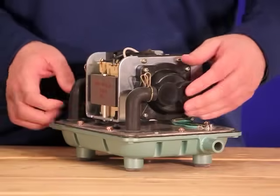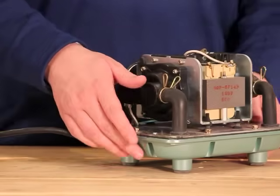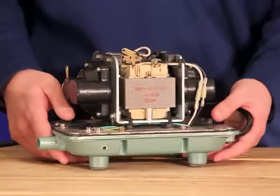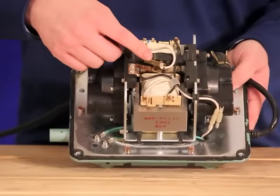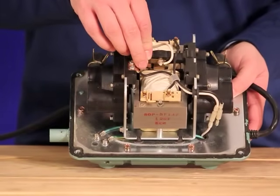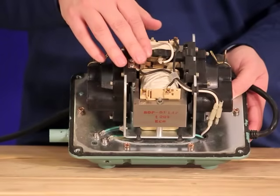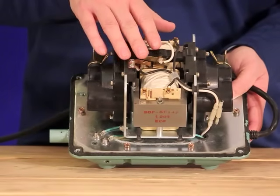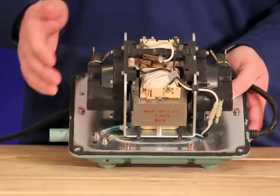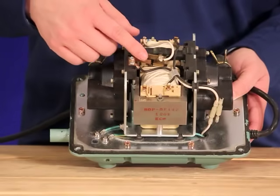Then you get into the actual pump, and you can see they're pretty simple — there's just a diaphragm and head on both ends with the tube connected to it. A lot of you may see the reason why your pump is not running is there is what's called a safety screw. It's a black plastic screw that holds the contacts together that powers the pump. That screw is designed to break whenever the diaphragms go out so that the pump does not hurt itself further. That would be why your pump doesn't come on at all — until you replace that screw it won't come on.